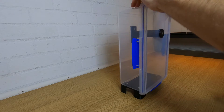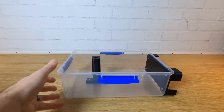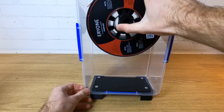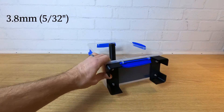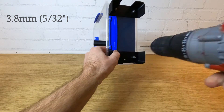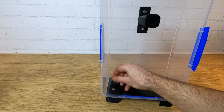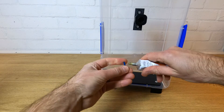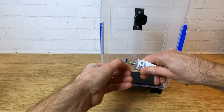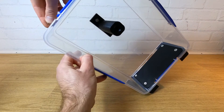It's unlikely you'll want your filament to feed out the bottom like mine unless you have an enclosure. If you like the look of my 3D printer enclosure then check out the other video on my channel where I show you how to make it and provide full build plans for free. Decide where you want your filament to exit your box and carefully drill a hole. I've found that a 3.8mm hole is best for a tight fit on the Bowden cable, but if all you have is something bigger just make sure you seal the gap between the outside of the cable and the box. Hot glue, blue tack, or something more exotic will probably do the trick. Alternatively you can fit a Bowden cable connector, but I'm trying to keep this project as simple as possible so everyone can make it.